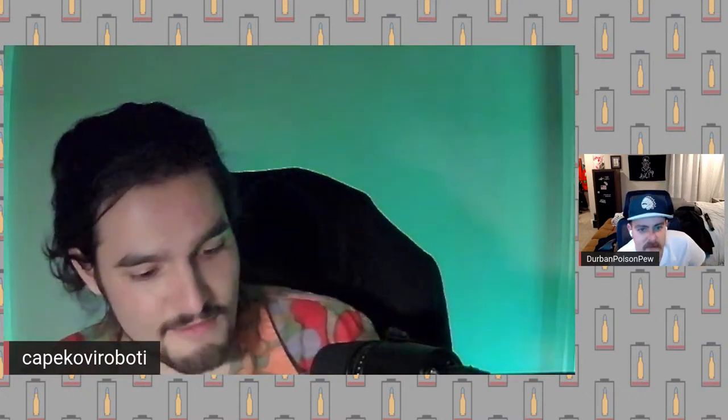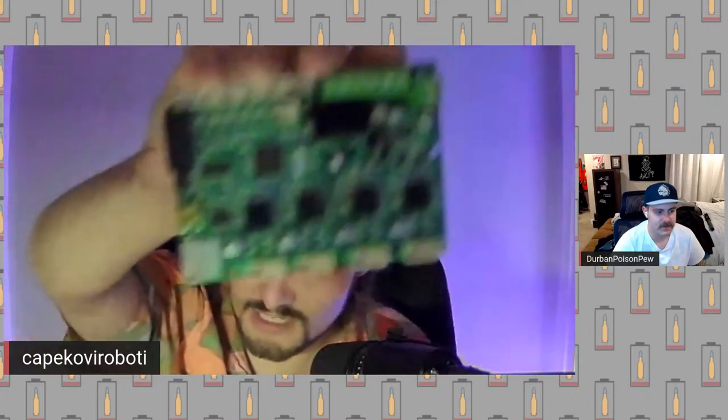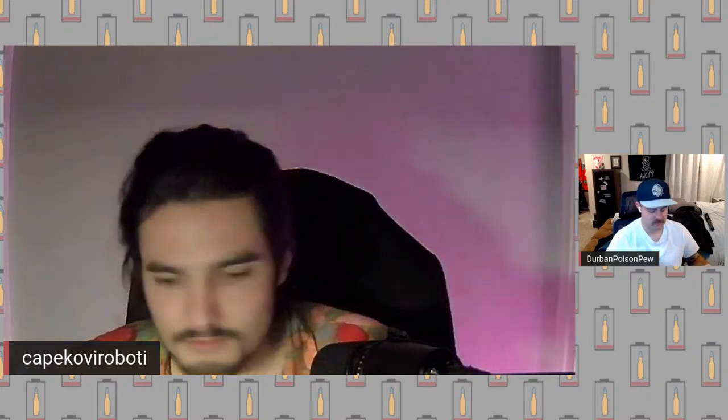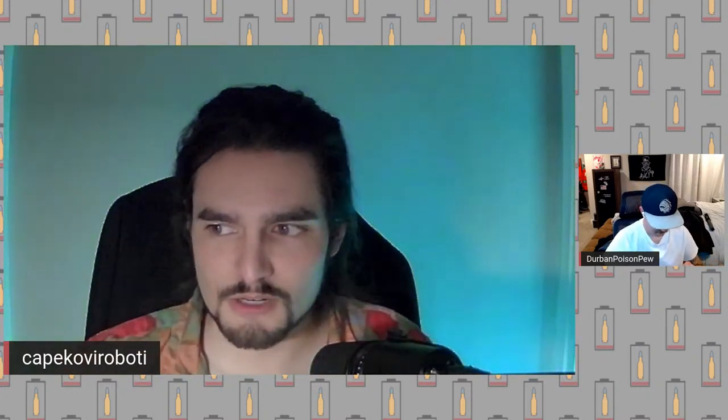But if you have a board like the one we're using today, or, dude, I have too many boards out, I can't find the one I'm looking for, or like this one, for example, that has integrated stepper drivers, in that case you most of the time don't need to change anything. So this is just a special case where Creality made the very poor decision to manufacture a board with integrated stepper drivers and then flip-flop on which integrated stepper driver they're using.